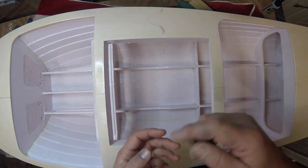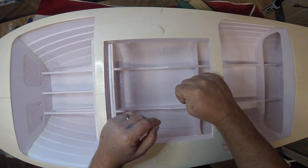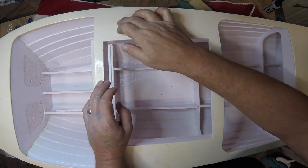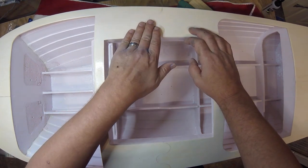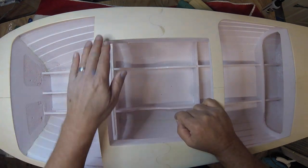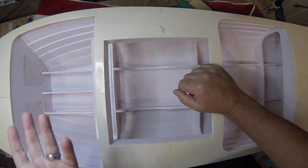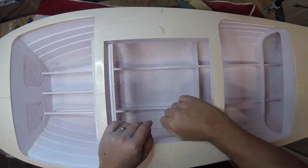I'm really hoping this works. Even if all it's good for is sealing, I'm excited, because I have not found a process yet that I really like for sealing. The other problem with doing just clear coat versus West Systems — West Systems is coming out ahead in this one — is when you have little tiny pocks. This is a very porous wood and I don't care how much you sand it. Clear coat is not going to fill any holes or dents. If you missed a tiny little nick and you're painting a dark color, that thing's going to pop out like a Pop-Tart. So West Systems will fill — it's an epoxy, it'll level up. Whereas clear coat isn't going to do anything for that.